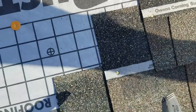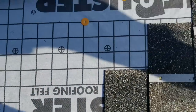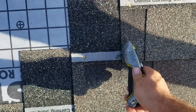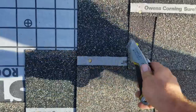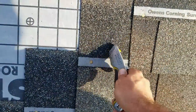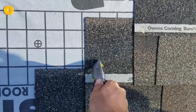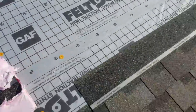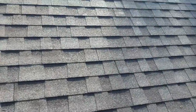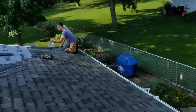Put your nail an inch from the end just like we've been doing. If you ever tear off a roof after it's rained you'll never see water pass right here — it can never get that far. If it can't get to this nail, it's definitely not going to get to right here and roll behind this paper. That's plenty on the stair step side — don't let anybody tell you different.